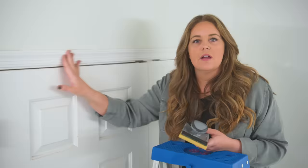When you start really looking at your walls, you're going to find all kinds of imperfections, and another really common one is old paint drips. This is from a previous paint job, and as you can see it's dripping down onto the trim. If we paint over that, you're just going to see it even more. I have 220-grit finished sandpaper and I'm going to knock down that old paint so it's nice and smooth — you'll never even know it was there.